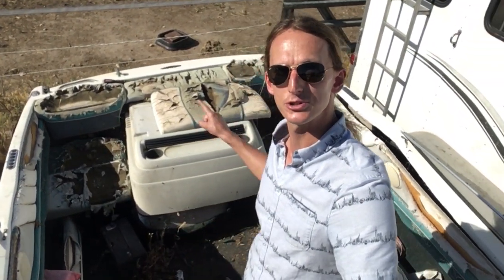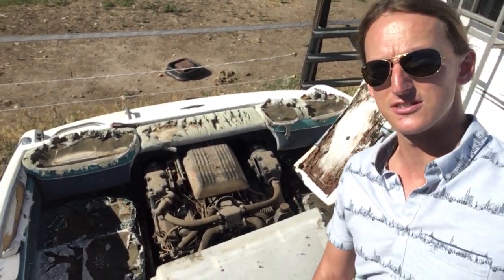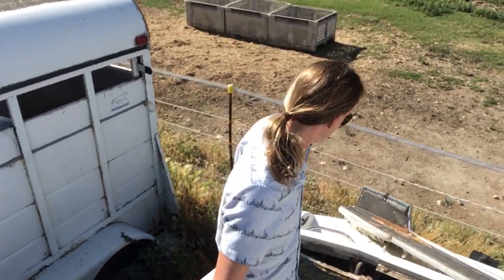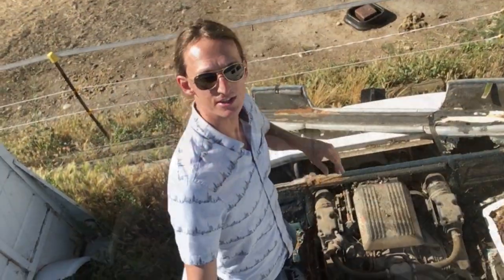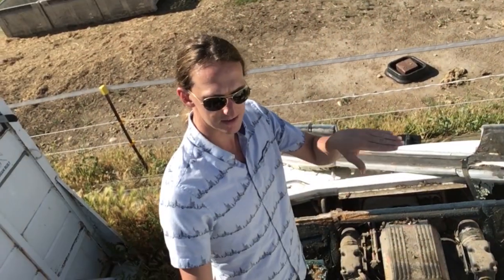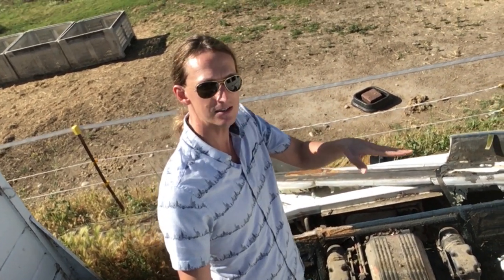So let's look at another telltale, and that's going to be your transom. To get to your transom, you usually have to pull the motor cover off. Don't be afraid to dig into the boat. Now, this engine's pretty dirty, but a dirty engine as far as dirt isn't necessarily a bad thing. What you're going to have to do is look behind the engine. Let me show you exactly what I'm looking at on the transom here. Just like you walked around the decks to make sure there's no soft spots, you want to make sure there's no soft spots in the transom. What I do is I take a screwdriver and I just kind of lightly poke. If lightly poking doesn't put any holes or go through, you're probably solid. But if you give it a jab and it goes in, that's a big problem — you've probably got a rotten transom.